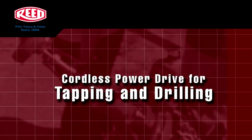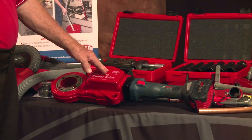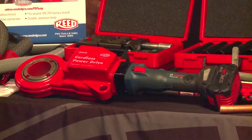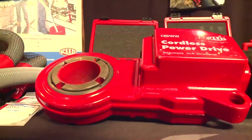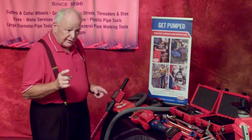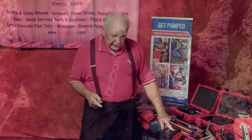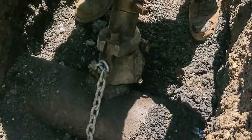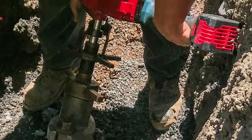The next product is our cordless power tapping unit, 18-volt powered by Bosch. This is going to make your life easier. The length and weight alone is half the size of what you're using now. The torque off this power head is unbelievable. I've done seven taps on one battery — three-quarter or one inch makes no difference. It takes one minute to go through the pipe and another minute to do the threading, and we're threading with the machine, not by hand.